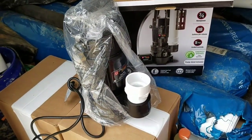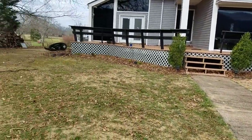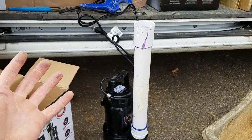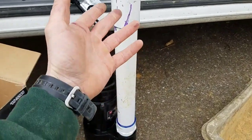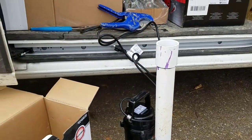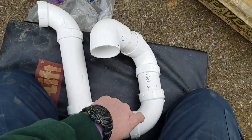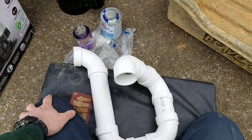I don't think this pump is even going to run a whole lot — it'll really only kick on during a super heavy rain like we had last week. I'm not going to put a check valve on this. Some people in plumbing always say you've got to have a check valve so water doesn't run back, but if any discharge runs back it's going right into the basin anyway. Instead, I'm going to build a P-trap on the discharge so after the water goes up and over, it'll come down into the P-trap and then down into the drain line — that'll stop any concerns there.